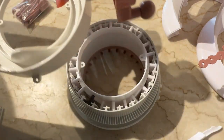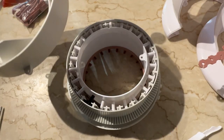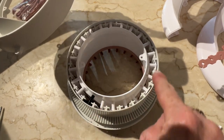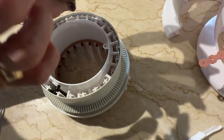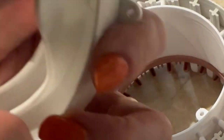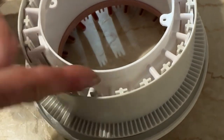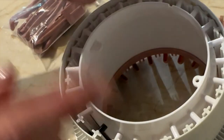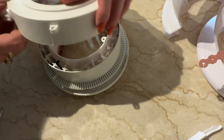I'm just going to spray that little gear wheel and spray all the moving parts so they run smoothly. You can see it functions pretty much like a zipper — it's very simple technology. This gear wheel on the handle just runs into that gear wheel, and as they go past a certain point each one of these little hooks just lifts up and down, which pulls the wool through when it's under tension. So we have a pointy bit, and the needles must lift up as they come around this lump. There is a dip here — this is what lifts the needles up.